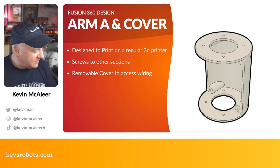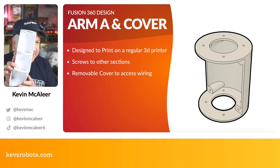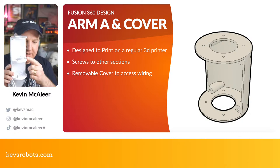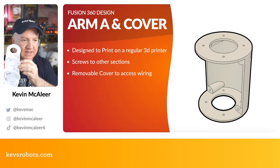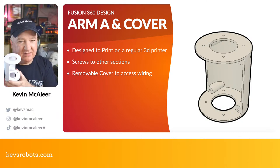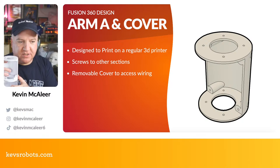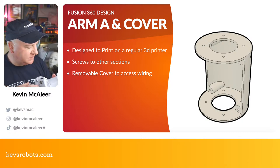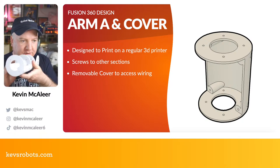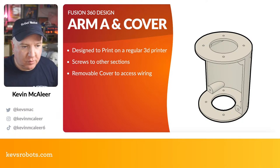So then there's a couple of different sections. I've designed these so that you can bolt them all together. You can see this has got 3 sections here, for example, and these sections just bolt together with the M3 screws. You can actually put a nut on the end as well, and I probably will even super glue these together. They've even got holes in there, so you can put the red section on the front and then close everything. And they've also got holes all the way through, so if you've got any wires, which we will have, it'll all be internal to the robot.